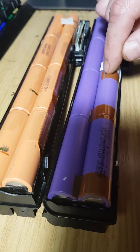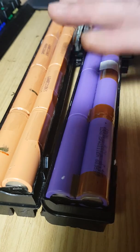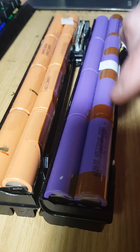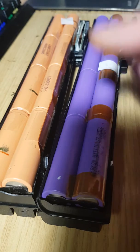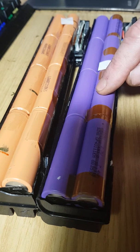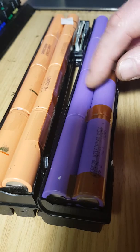And I see a lot of people, particularly on YouTube videos, swapping and interchanging cells from one to the other, not paying any attention to what the constant voltage charge is. And everybody thinks, well, yes, you can actually increase your milliamp hours. So, for instance, these being 2200s, supposedly, hypothetically speaking, you could then put something like a 2800 or a 3000, even a 3500, like one of the big Samsung high energy cells in there. I think Panasonic do some which are 3.5 amp hour cells, and you could put those in there. Now that would be fine, provided the constant current and the constant voltage charge to these cells coming from the PCB's regulation circuit and control chip is correct and correctly maintains the charge in those cells.